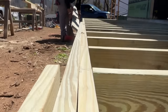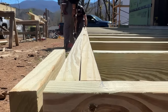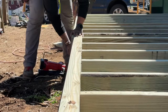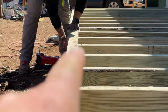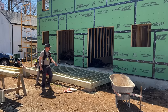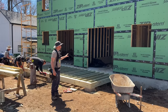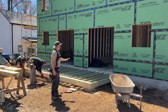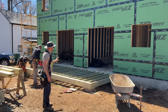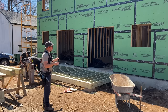Checking out our girder and it looks straight enough to roll with. I did bop it out just a little bit about two-thirds of the way — you can see a tiny gap right there where I straightened it. We're wrapping up joist installation and will add joist hangers to the front. We're going to put on some sheet goods for now since we don't have the finished decking — we've had bad luck installing finished decking at this stage because then all the other trades like drywall and paint damage it.